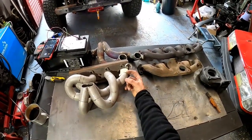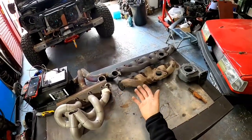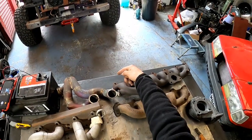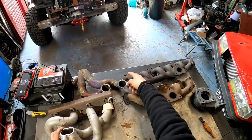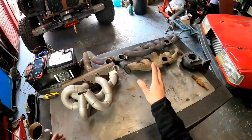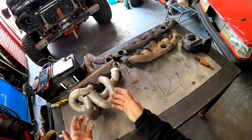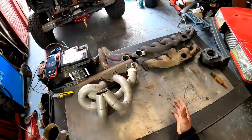Unless you got one which is really short and the other one is hugely long. Like you can see on the 6-cylinder engines, for example, when the flange is here, and they have one runner straight into the flange and the 6th one going from there all the way here. That's wrong. This one should go all around, make some length and come back. I've seen this so many times and that's bad. But if you got some differences, it doesn't really matter too much. Sure, it would be better if they're equal, but it does not make a huge difference. So don't concentrate on that.